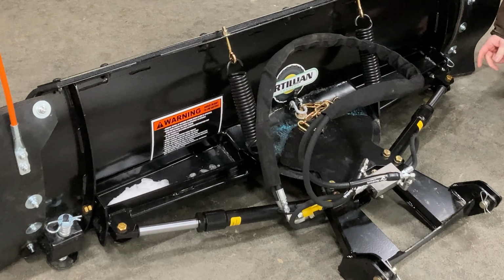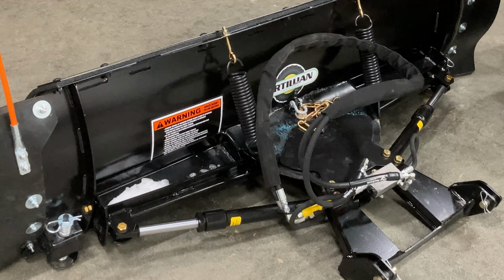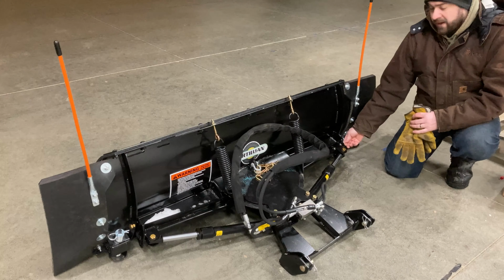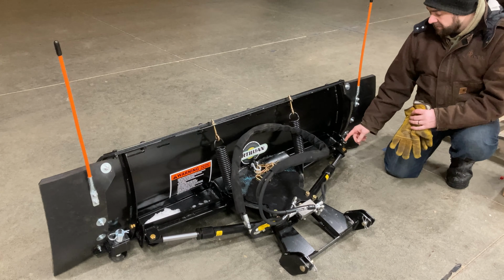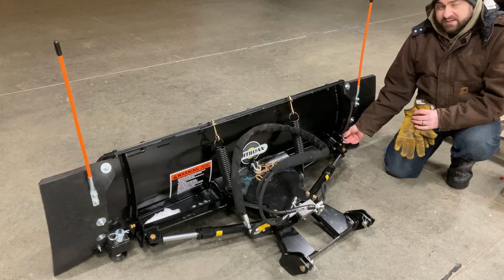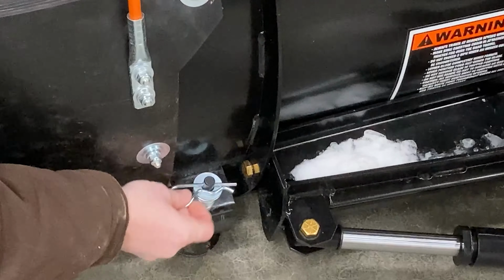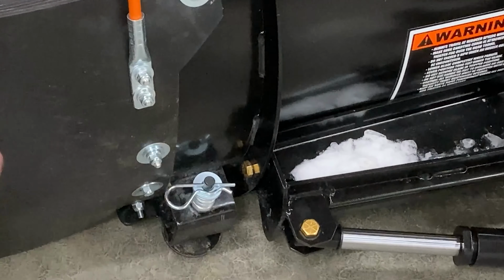So I think what happens is, I had these skid shoes down so far so that I wasn't scraping up any gravel, but those were catching on stuff and the pin wasn't able to take the force, and that probably sheared or bent or broke out of here, and that's why I lost the top section of washers and the pin. Now you can see I put the heavier pin and some new washers on this side also,